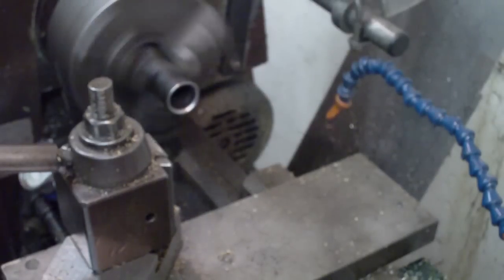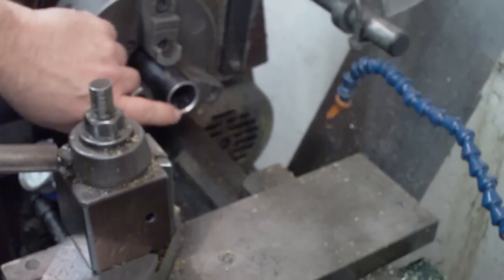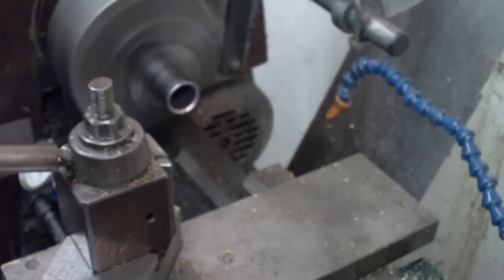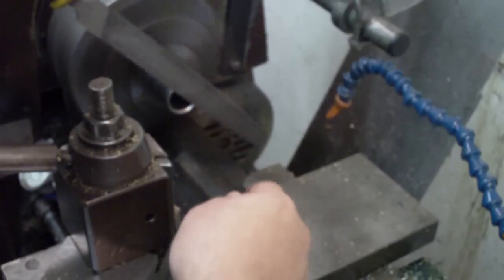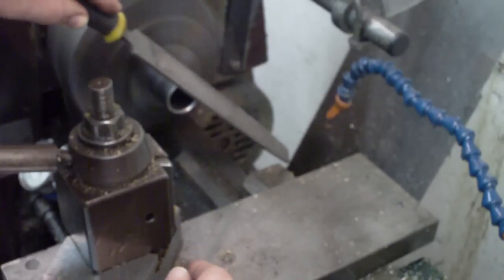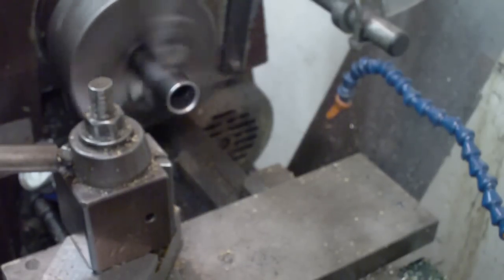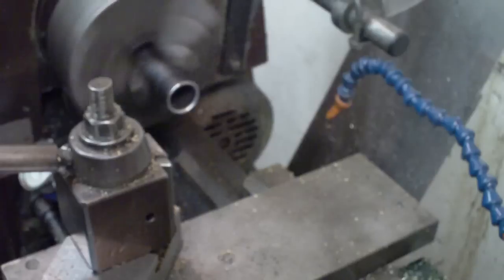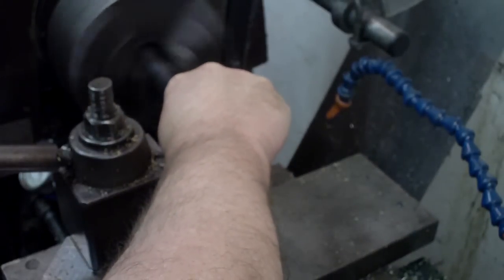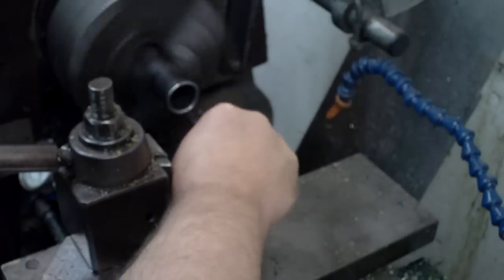Unlock it. So the chamfer's in there. The problem now is there's a little ridge on the outside that'll cut somebody, so we're going to take that off with the file. We're going to crank it up to 1190. The file almost goes beyond the chuck — stick it in there, all it takes is a little touch. Got to lay it off. Put it in low gear. It's a deburring tool — it's just going to take anything off on the inside so if somebody sticks their finger in there, it won't cut them. That's all there is to it.